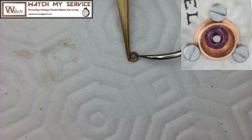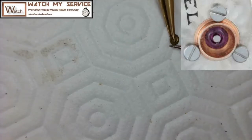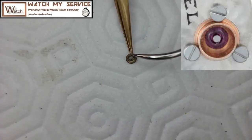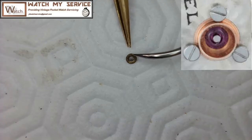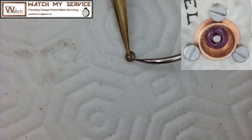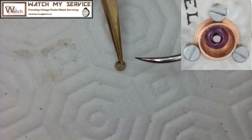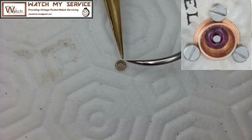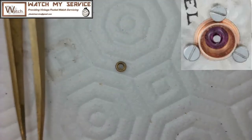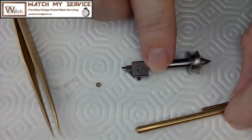You very carefully cut a groove which leaves a little bit of material on the inside of the setting to cover and hold the jewel in place — like the movie Alien, it grabs the jewel. You then burnish the jewel in with a special tool that pushes the metal in. The first critical step is cutting that groove — and this new tool solves a lot of that.